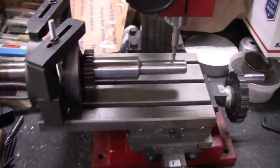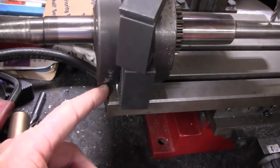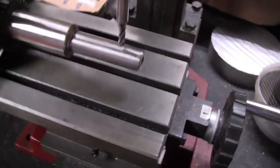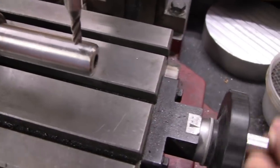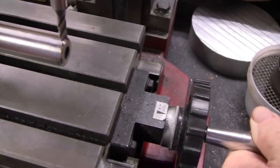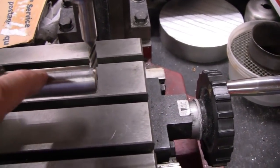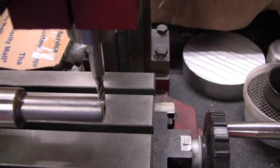All right, I set the crank up here in my baby mill, and it just barely makes it. You can actually see the counterweight I have sitting off the end of the mounting plate, just so I can get enough travel for that end mill. And it gets tight right there and stops just about at the end. So I would probably be able to use it, but even with the end mill, sometimes you're not going to get a good cut. It would be good for what we're doing here, but you're better off with a keyway cutter.